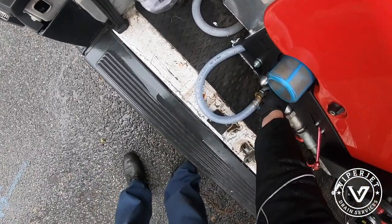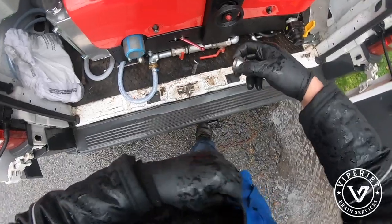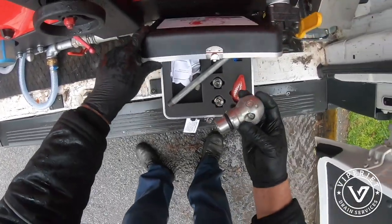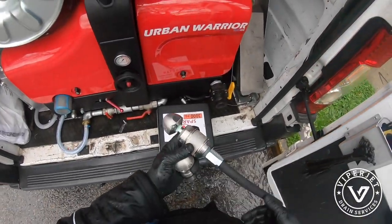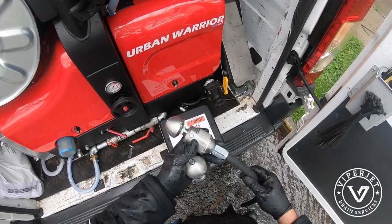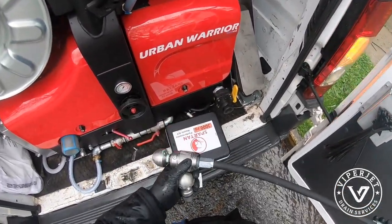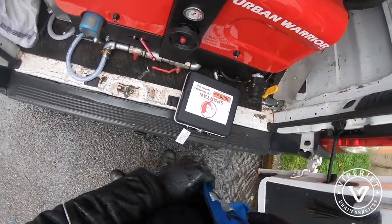Okay, today I'm going to be using this flusher. After I cut the roots, I'm gonna use this so I can push them out. And I'm going to be using the Warthog. This is all brand new, by the way. I just got this jetter. This I used already and it worked great. I don't want to use this. This is the big Warthog, but the line is so poor, meaning the cast iron, that this may get caught on shifts and things like that. So I don't want to use this for this situation. This is an animal though. When you use this, two passes and that's it, you're done, no matter what it is, grease. But for this type of job, I'm not gonna be using that. So I use these two guys right here and I should do it.